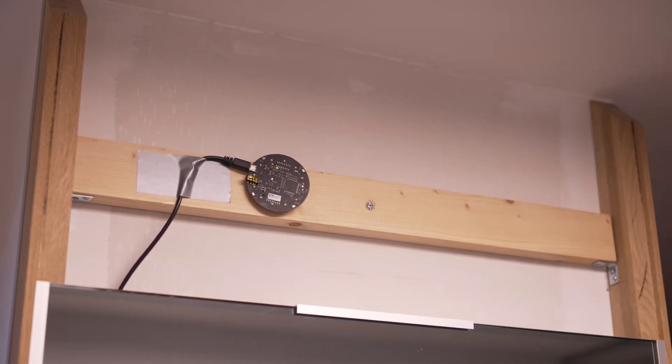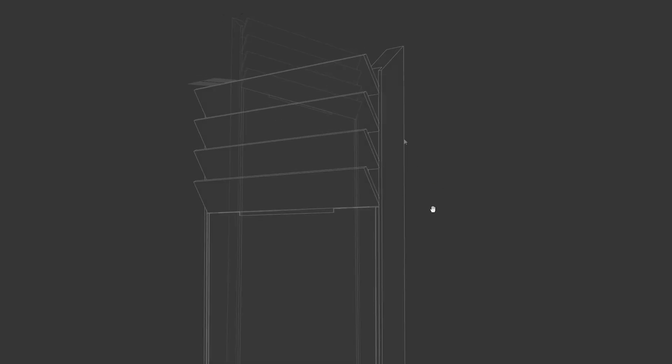It was very important for me to get an impression of professional manufacturing here, and I'm very satisfied with the results. The side profiles and the top brace actually only have a supportive role. The top brace stops the glass from falling forward, and the side profiles make sure the glass won't bulge out, as this is a relatively tall structure. The heavy lifting, though, is done by the lower brace, which carries all the weight of the mirror. This brace is bolted to a wooden crossbar behind the glass, and the whole structure is held in place by one single screw to the wall. The undone part here will be covered by oak panels so that the heat can still dissipate.